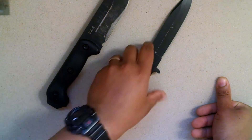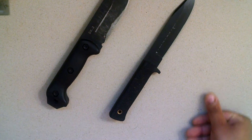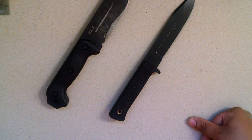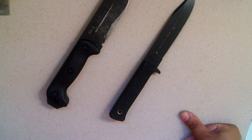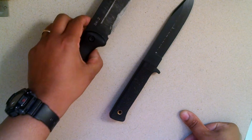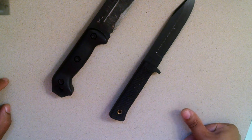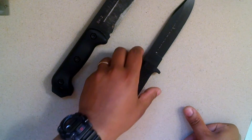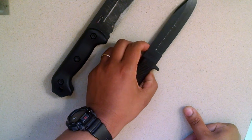There won't be any cutting or tests or anything like that, but often I run into folks and they tell me, you got to get a carbon steel — it just cuts longer, holds the edge longer, all this and that. And yes and no. So the carbon content — carbon cuts, that's the old saying — the thing is that most high quality stainless knives actually have more carbon than 1095 steel.